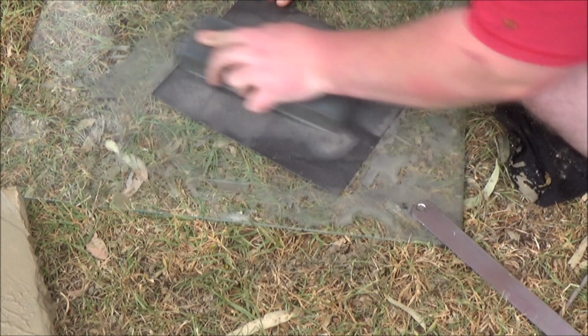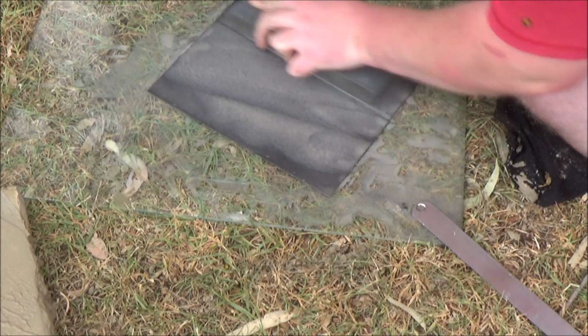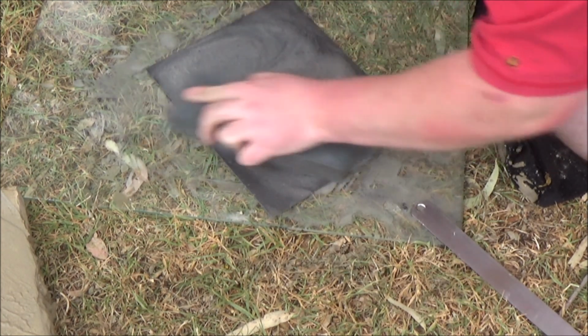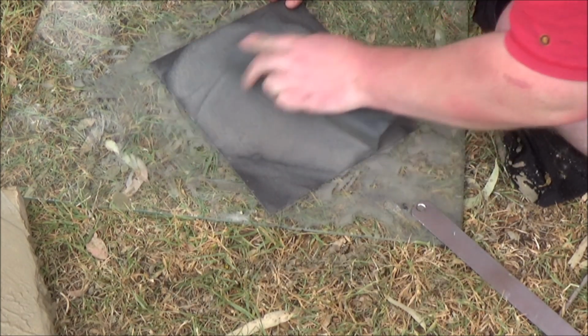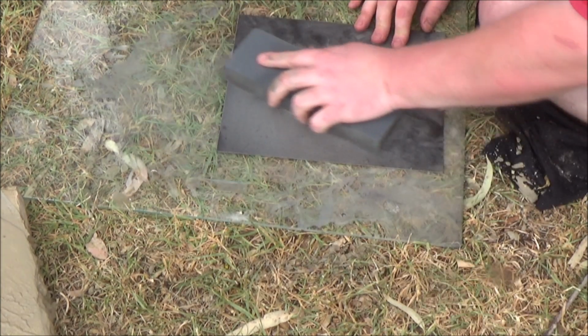You can use sandpaper for the whole process, but as oil stones are generally a lot harder than water stones, you would use so much that it isn't really worth the money, which is why I use the sand. You can also do it without sand, just on the paver. It just takes a fair bit longer. It took me just under an hour to get this stone back into shape.